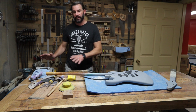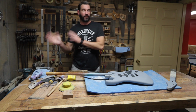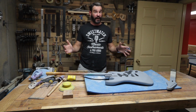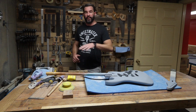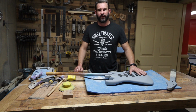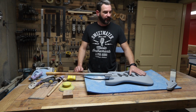I would rub it down with naphtha between the sandings and sprayings, to make sure I was eventually getting to a spot where I've filled in all the grain and can't see any more. I think we're there. It's been about 5 more trips of primer and primer filler. I've used 4 cans, I think: 2 cans of primer and 2 cans of filler primer.